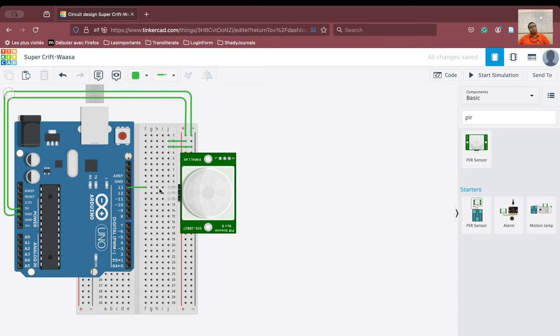Okay, so therefore if I want to connect my power to this particular 5 volt one, so this is the 5 volt one, what we have to do is bring from here and take one connection from here and we will connect this to the power, so we can connect it to this particular hole. We can see here, so what we have now done is connected this particular wire from the 5 volt connection to the power pin of the proximity infrared sensor.